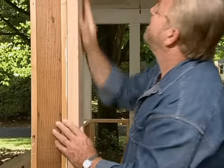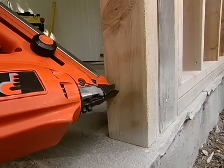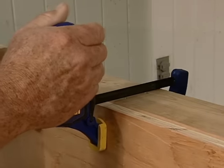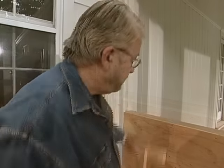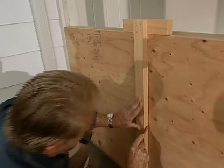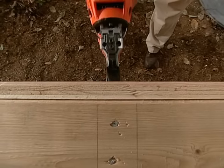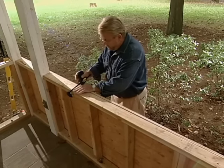This wall is going to have a glass sliding door; all I have to do here is add a couple of two-by-fours to reduce the rough opening to the proper size. Next I want to begin enclosing the structure by applying plywood sheathing on the outside. I tilt the sheathing up, slide it into position, then attach it with a clamp — this leaves my hands free to work. A couple of nails along the top hold the plywood in place. A simple T-square I made from scrap 1x2s lets me quickly draw locator lines for the studs, making sure every nail finds its mark.